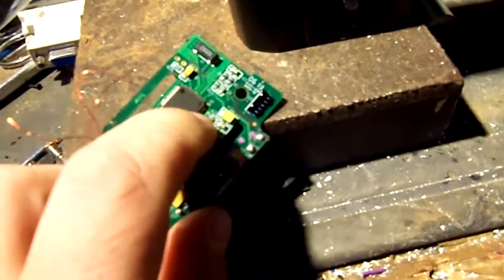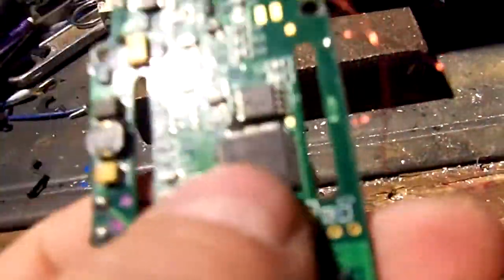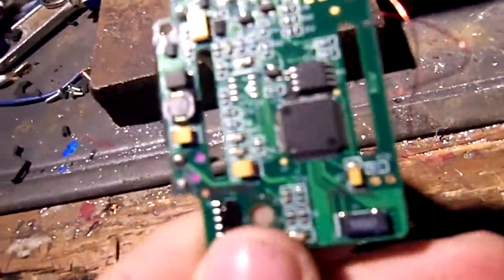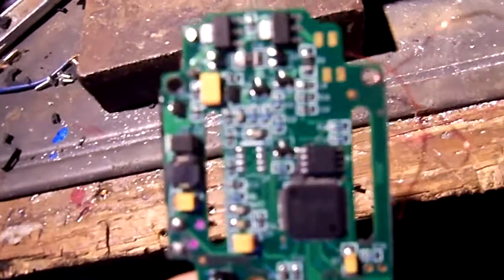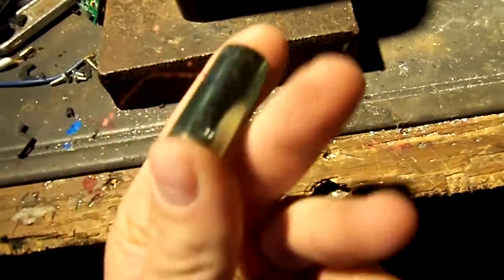The keypad and the lock actually talk back and forth — two-way communication. It has a Texas Instruments microprocessor on there; I want to say it's 16-bit or maybe 16-kilobit — you could look up the specs. It is an MSP430F147 microprocessor. There are also capacitors, what looks like an op-amp, transistors, resistors, programming contacts, a big capacitor, and a 3-volt lithium battery.